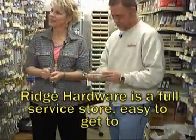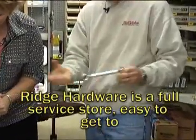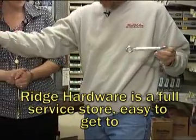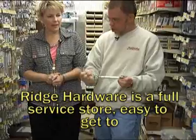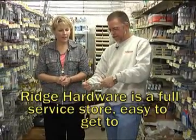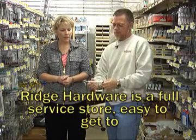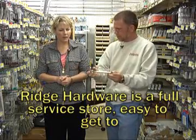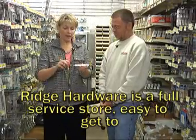Hey, this is a turnbuckle. So you've got 2 chains, and we actually use these down at the farm. You've got a chain or a cable going to either side of, for instance, a wall that you need to hold together or hold in. You chain it on either side, and this lengthens on both ends. This one's a little tight, but as you screw this, they all come together to tighten it and keep it tight. Very good, you win on this one, ding ding.